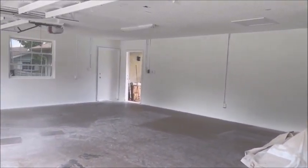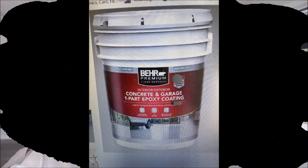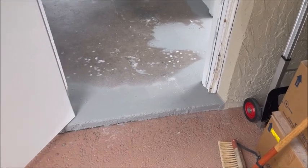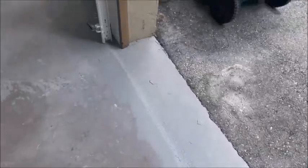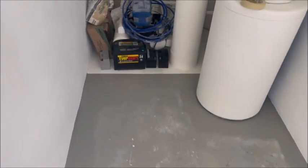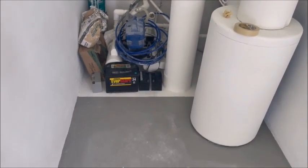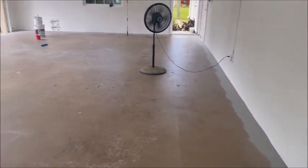Just wanted to give everybody a look at the garage from the outside looking in — looks a whole lot better, that's for sure. We're almost ready to paint the floor. You'll see that I've cut everything in along the wall edges, in front of the doors, and in the corners. Back here I ran a piece of tape to split the gray and the white — no sense painting the back gray since nobody goes back there anyway. We're getting ready to roll the floors out.